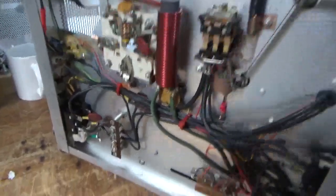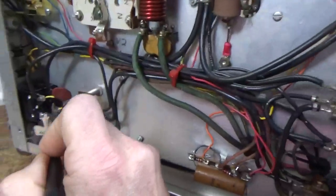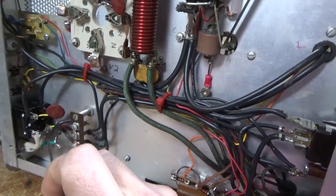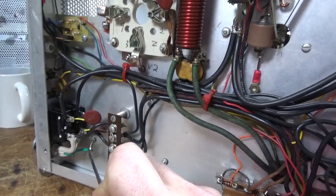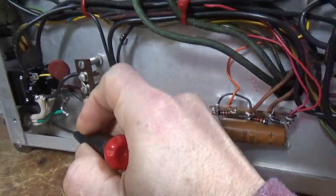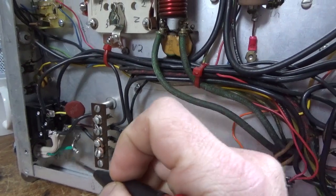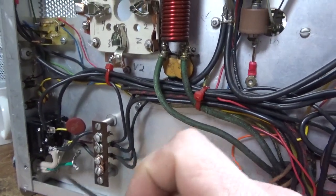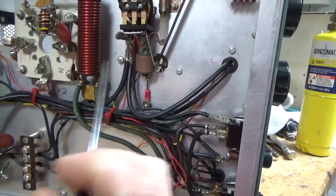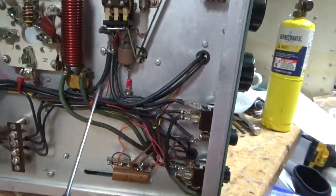Here's the bottom. Customer said he changed the circuit breakers. Those are bad joints — redo all that. It has the bypass caps here connected to the ground, but this tab here is supposed to be connected to the chassis over here, and these bypass caps also connected to that same point. We'll put the soft key in. He had the soft start in, but he had a short on start-up and blew the resistors — one or both — so we'll remove that.